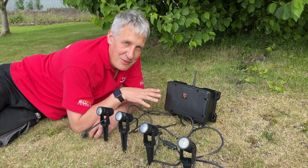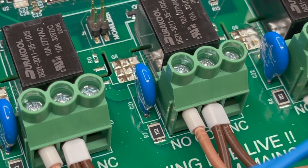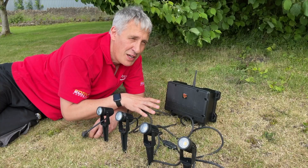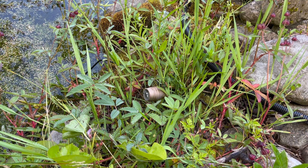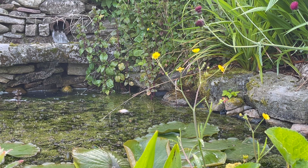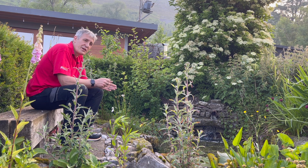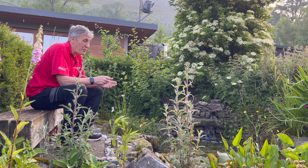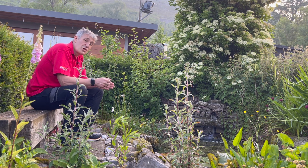This dual band receiver has four independent channels that can switch up to one kilowatt from a volt-free contact, making it great for garden lighting. You might want to switch it from inside the house or outside the house - this is where this product comes in. There are lots of other things you may want to control in the garden, such as pond pumps, electric patio heaters, or even electric gates. The four independent channels are really useful because they can be completely different electrical circuits, so something with a high inrush current such as a pond pump or LED driver isn't going to affect other channels.